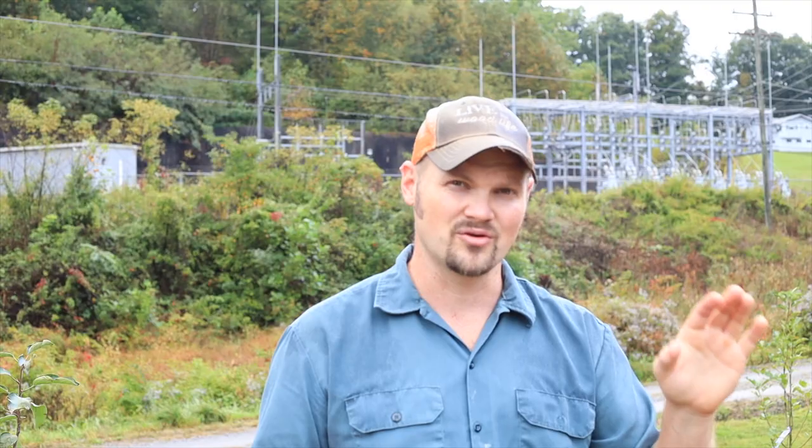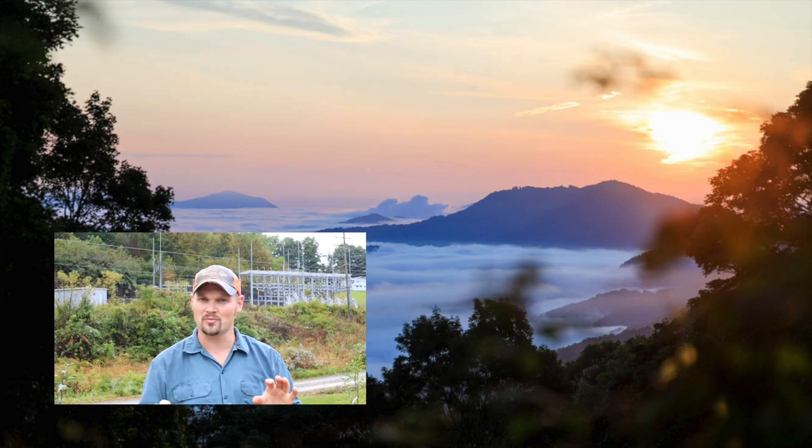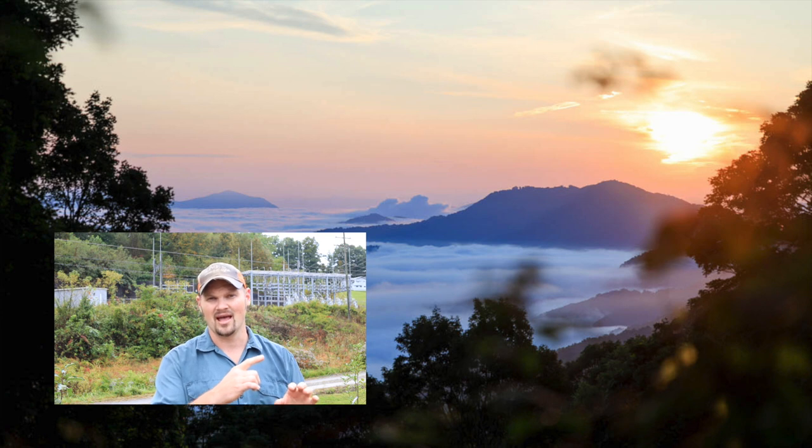With soft woods like pine, you might use a ten degree angle, which cuts larger chips and you'll need more space for that sawdust above and below the blade. The sappy wood needs to pass through easily — any friction will cause the sap to melt out of the wood, stick to your blade, get on your rollers and wheels, and just mess everything up. If you want to really get into the nitty-gritty of how to sharpen and set blades properly, sit down and watch the next video for all the insider tips and tricks.